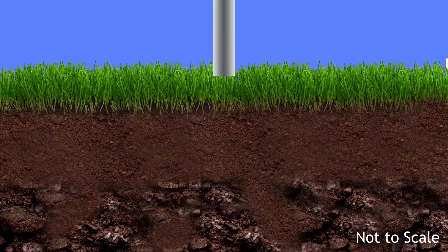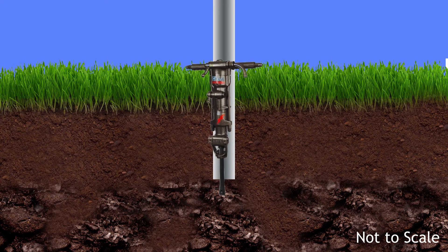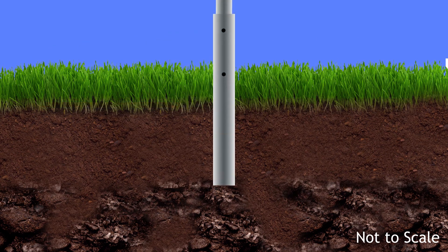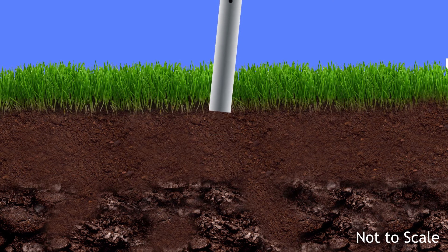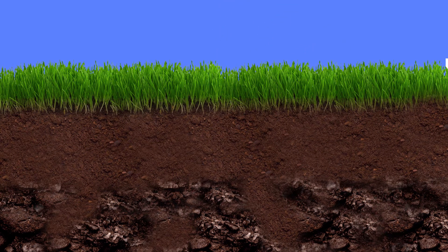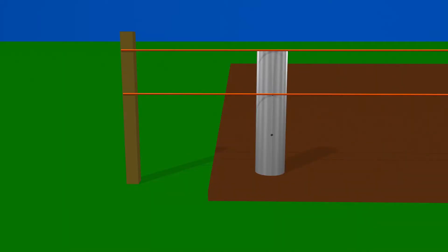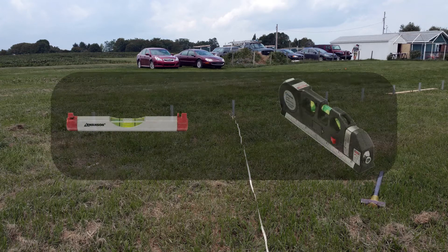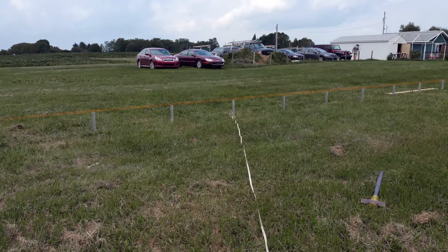If the collar is stopped by underground rock, a rock drill or other tool should be used. You could shorten the collar, but it is not recommended as it can weaken the structure, especially if you hit rock with multiple collars. Now, place a stake into the ground next to the collar and run two strings down the length of the tunnel and attach them to a second stake. Set the upper string height to the top of the collar, and set the lower string to either of the side holes. Also, attach a string level or use a laser level to ensure the remaining collars are in line and level with each other.